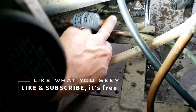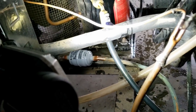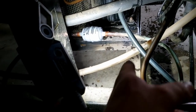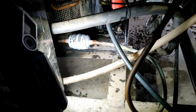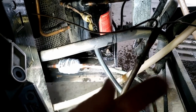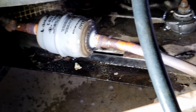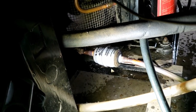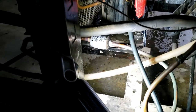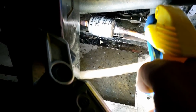We've got the nitrogen set up — I'm going to bleed that out as much as we can, then cut the pressure and get it done. All the oxygen will be displaced; that's about the only way you can do a cap tube system — if you try pushing through a cap tube it's not going to happen. You could try pushing through the suction side backwards, but this is going to work just fine. Got it burned in there — almost impossible not to burn the paint a little bit. Going to pressurize it again and spray it to make sure I don't have any leaks.